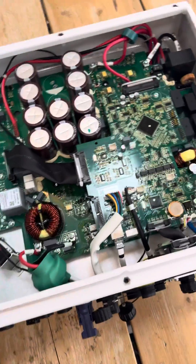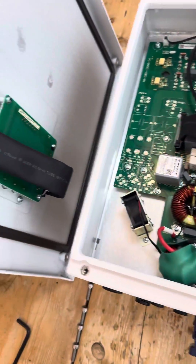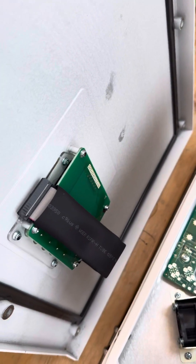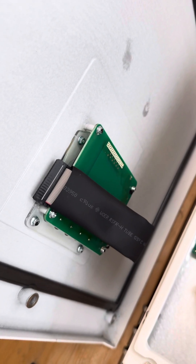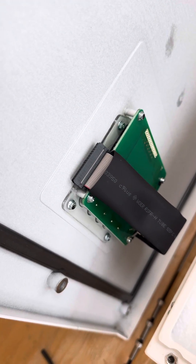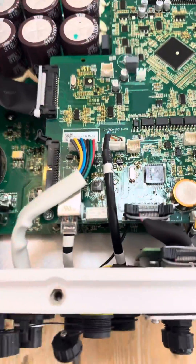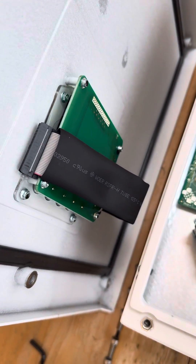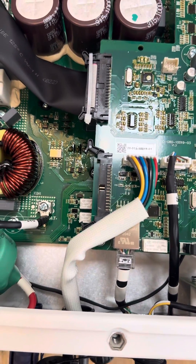So what we'll notice by opening it — first of all, there's a lot going on. There's the sticker that you void by opening it. There's a very thick rubberised weatherproof gasket going around the edge — that's really good. There's some sort of adhesive holding on the other side, but it's big and spongy, and that interfaces on the inside of this lip. You can see there's actually a step, so that will all keep it nice and IP rated. There's a data connection going to the front screen — I've just popped that out from this connector here, just so I can get the lid out of the way for this video.